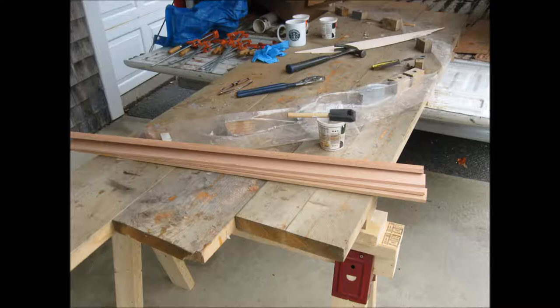Then I took the frames that I removed, laid them on the framing jig, drew a line of the shape of the frame, and then bolted blocks of wood to the framing jig along that line. After that, I cut out strips of oak and glued them up and clamped them to the framing jig. So we're going to see that procedure step by step.